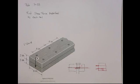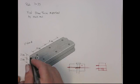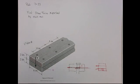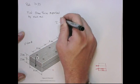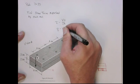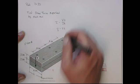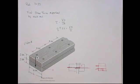To get the shear force on that plane, we're going to use the transverse shear equation of the beam. We use the Q for this section — that area is going to be the Q. So the shear on this plane from transverse bending is going to be VQ/IT. Normally we multiply by T to get the shear flow, which is stress times thickness — that distance is the thickness. Shear flow equals VQ/I. So we need to compute the total I and then Q. The V is given.